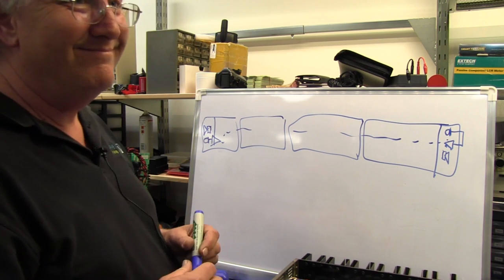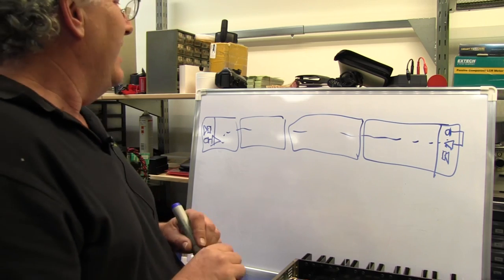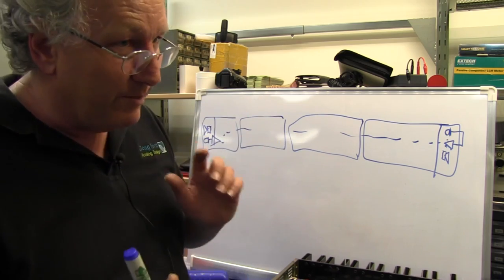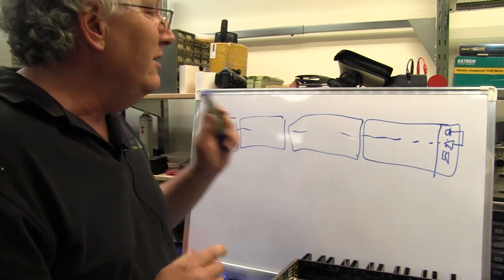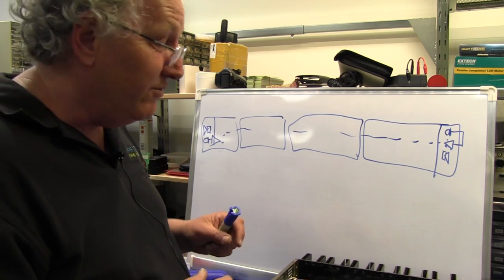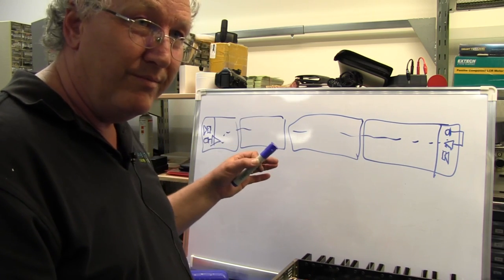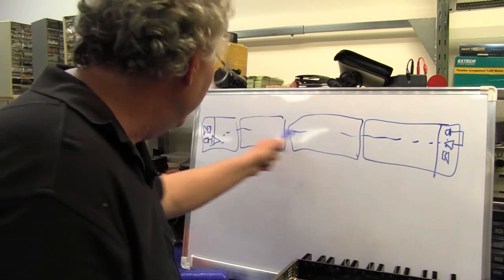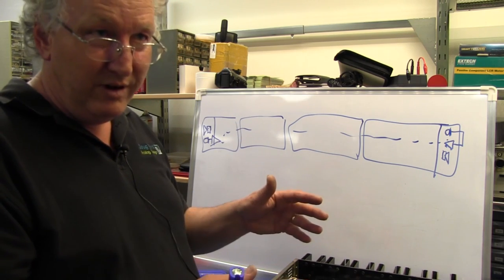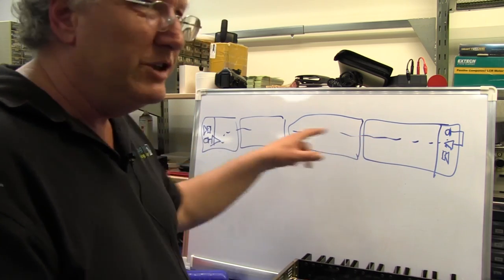Okay. So this is a half duplex push-to-talk system, if I've got the terminology correct. Yes. Now, this is for the intercom system. We haven't addressed the PA system yet. The intercom system can use relatively low power amplifiers, and in this case we are limiting the power here to 30-35 watts. The lines connecting all of this run at nominal 100 volt levels. Yep. So it's a fairly high voltage level, very few transmission losses.